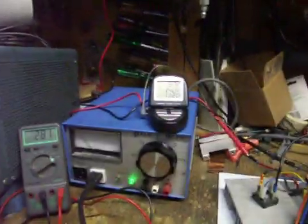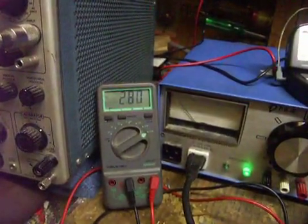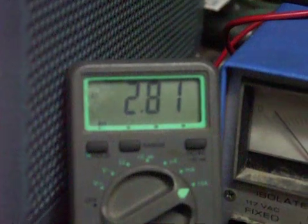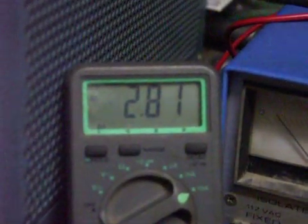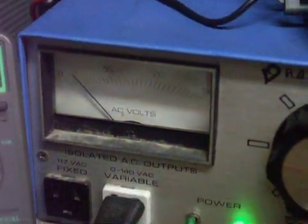Here's how I'm using this. This is my oscilloscope. This is my AC voltage going into my transformer — I have 2.8 amps. It's running at 13 volts AC to simulate a PWM driving my toroid.